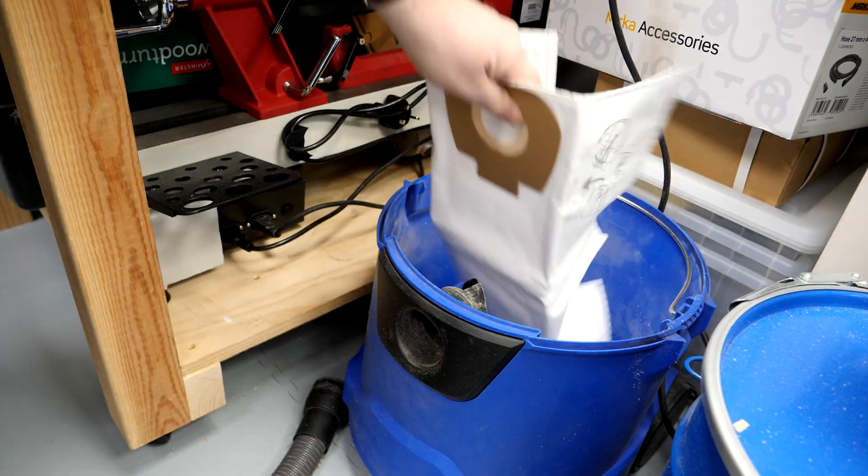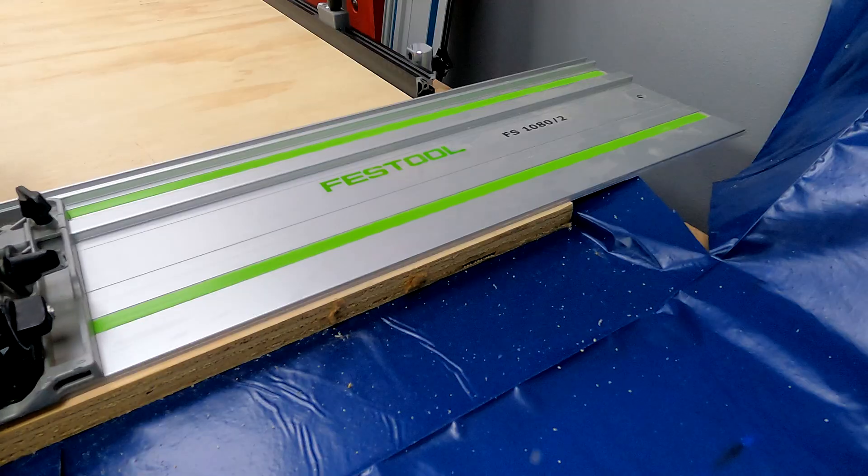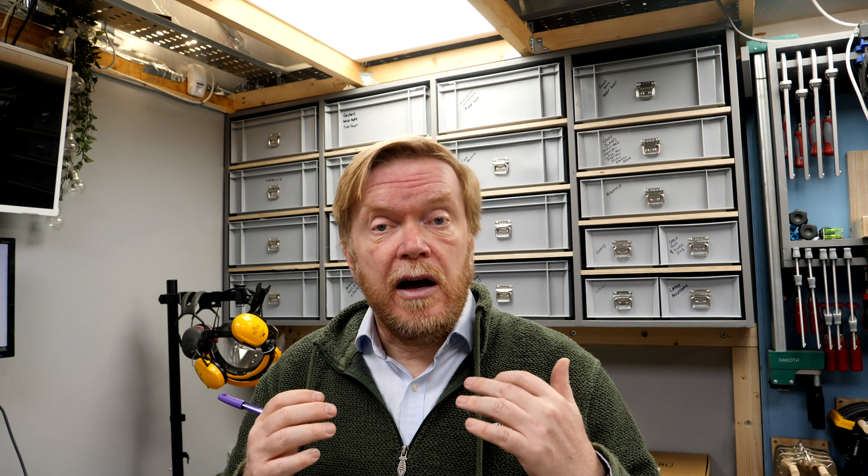So the method is going to be quite straightforward. I'll put a fresh bag in my Nilfisk vacuum and connect that to the saw. We all know that there are certain types of cut that create more dust than others — in particular a trimming cut, which is where you just go along and remove a slither of material along the edge of a board. So we'll make five of those. We'll do that first for the saw without any tape, and then we'll put the tape on and run the tests again, and at the end we'll see what we've got in the way of dust on the bench. I'm using a bin bag to make all of that much easier to see on camera — a dark blue bag with largely light-coloured dust should be pretty easy to see, and I'm assuming that the proportion of dust in the air will be relative to the proportion of dust that we see on the bench.